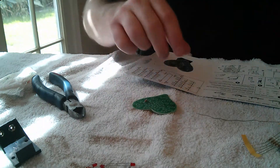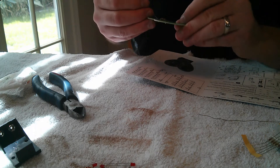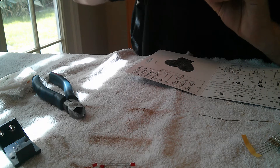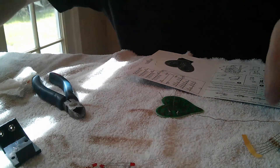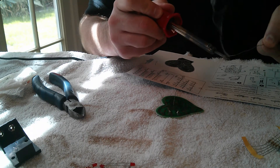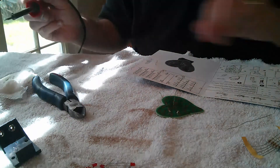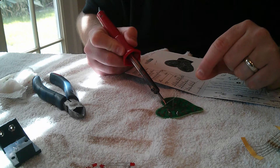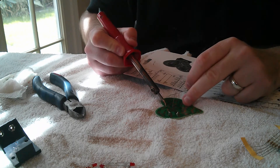Now we're going to blaze through and do the other resistors real quick. So there's R1, let's find R2, which in this kit is right here, labeled R2. Put the component in. Again, make sure you tin your soldering iron — get some solder on there to get the oxidation off. Wipe the oxidation off onto a wet paper towel or sponge, heat up the lead, and let the solder flow.